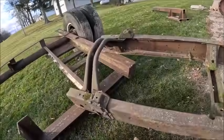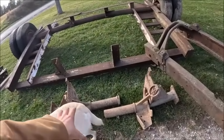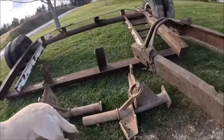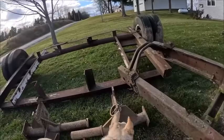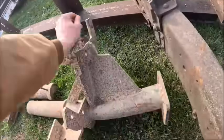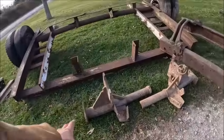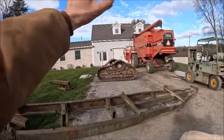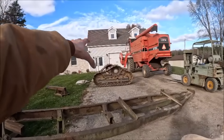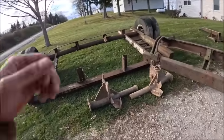It catches four bolts on the back of the final drive or on the back of the axle spacer — one of the two — we need to figure out which one. We'll have to weld some plates on the axle to catch these. Whatever this thing was on originally must not have been symmetrical side to side, because this subframe has a ring in it that gets back behind the axle and bends up. That had to have taken one heck of a press because that's a four-inch solid shaft with about a 25-degree bend in it. The other one is just straight. The sprockets show no signs that hubs were ever cut out and new hubs welded in, so they must have bought the correct sprockets for the White when they did the conversion.